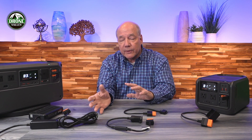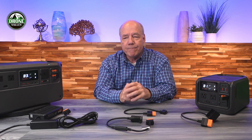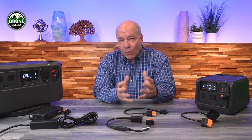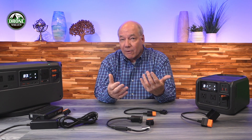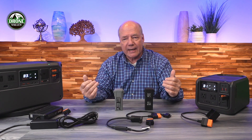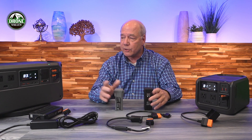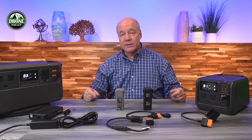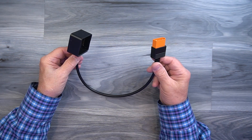The two adapters I really like are the ones for drone batteries — I fly the Mavic 3 and the Air 3. Using even the 100-watt USB-C hub could take up to an hour or an hour and a half to charge those batteries depending on depletion, because the Mavic 3 and Air 3 batteries are gigantic. The challenge with USB is it can't really deliver current at the speed needed to charge these quickly.